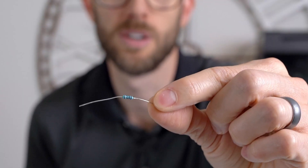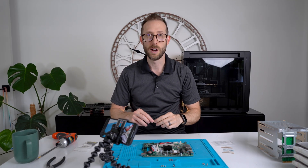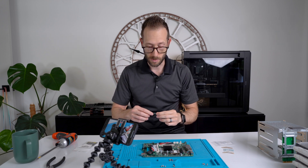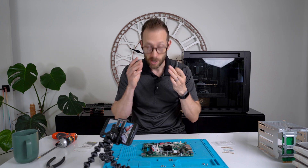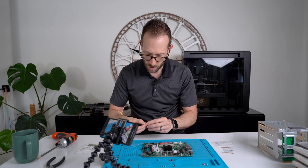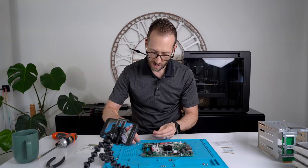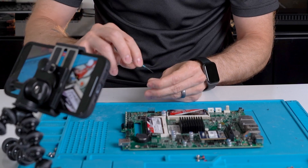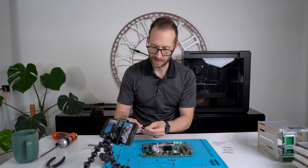You can see the resistor. It's 100 ohm. They had a quarter watt and a half watt — I looked through the comments and someone on Amazon said they used the quarter watt to fix this exact problem, so I went with quarter watt. The idea with the jumper pins is that one side goes over the actual pin here, and then the other side you put a leg of the resistor inside, which will connect them together.